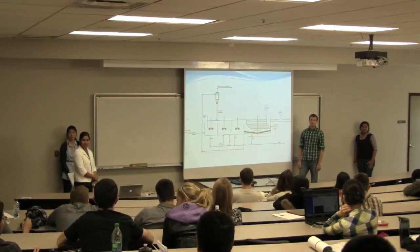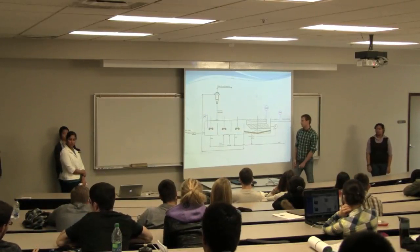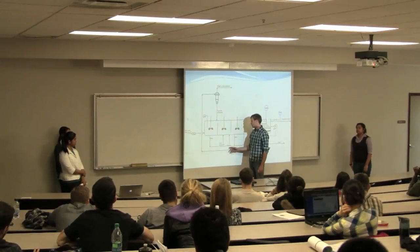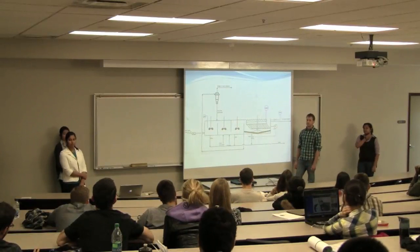Sorry, what was the problem again? The turbidity in the outlet pipe is too high. And it's caused by what, sir? The sand. Yeah, the sand. And the polymer. Or the turbidity level in the inlet is too high, and increasing the sand and the polymer decreases the turbidity level because it increases the level of flocculation.